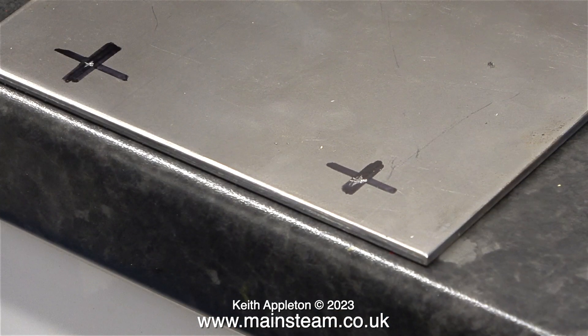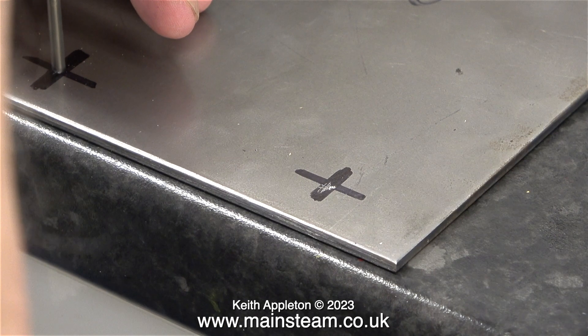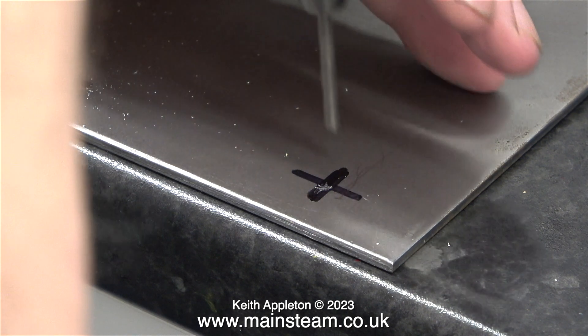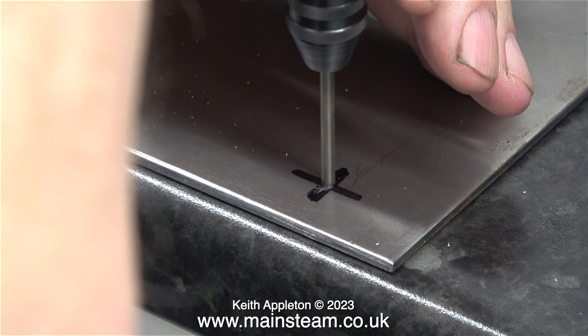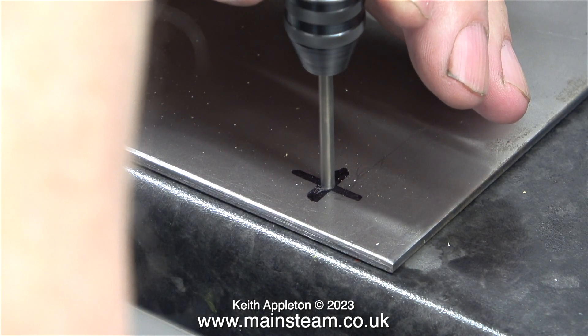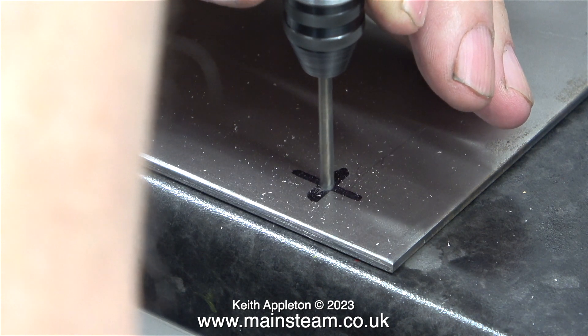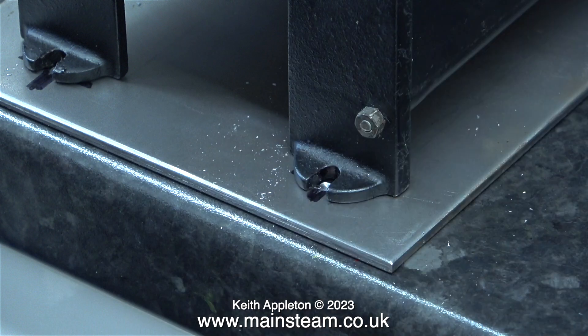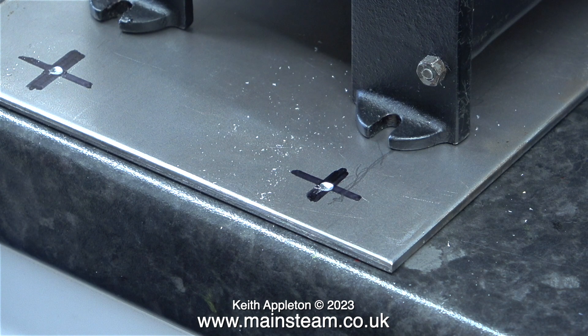Here you can see the marks left by the twist drill, and I am aware that they are not in exactly the same place relative to each other. That's because the castings that support the boiler are not 100% accurate. I'm now making a deeper mark on the points where I want to drill the holes, and for this I've fitted a 1/8th of an inch twist drill into my Proxxon motor tool. These twist drill bits are really sharp — I cannot think of a quicker way to blunt small drill bits than to use them running at high speed attempting to drill steel, but in this instance the twist drill cut so easily I had to be careful not to go all the way through.